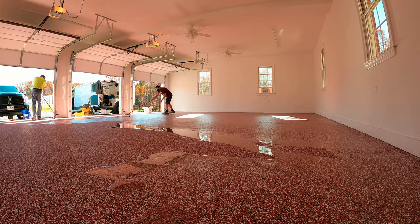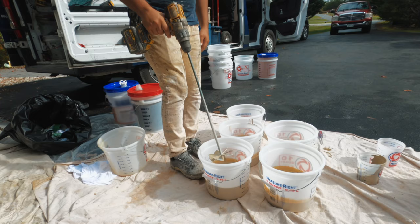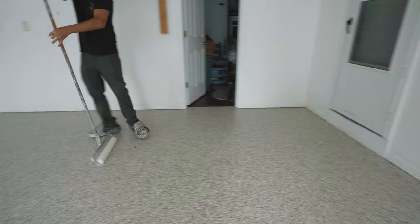In the past three or four years, the garage floor industry has exploded and people are always trying to find an edge on their competition. That brings us to the fourth type: the one-day floor system. A one-day garage floor has the exact same polyaspartic topcoat I mentioned before. The only difference is in the primer. One-day companies use a polyurea or polyaspartic coating as a primer because it dries in a couple of hours, allowing them to prime and apply the flakes before lunch, let it cure for two hours, and then apply the topcoat after lunch — completing the entire job in one day.